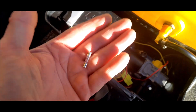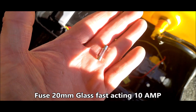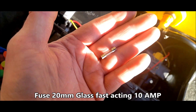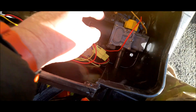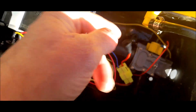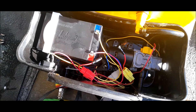I've pulled out the fuse — it appears to be a 10 amp 20 millimeter glass fuse. I've got no associated problems with the fuse itself. The next thing to check is the inside of the fuse holder to make sure you've got no corrosion — dissimilar metal corrosion, galvanic corrosion from mixed metals with moisture. There's nothing there, so the next part is to find the next part of the fault.